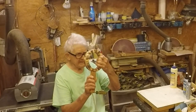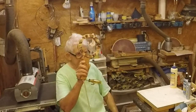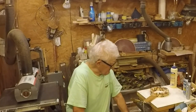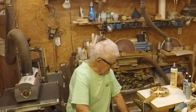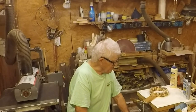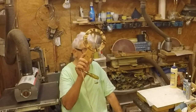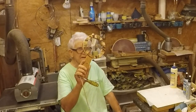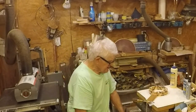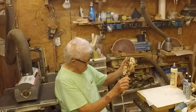And in this case, the joints are not tight. They are definitely not tight. Means I've got to change the angle on one or two of them. As much as these are loose, I'm probably going to have to change the angle on two, maybe even three pieces to get the joints tight. I don't believe they come out that far off, but they did. They're loose on the inside. They've got a gap on the inside.